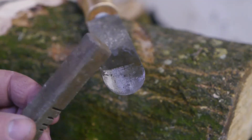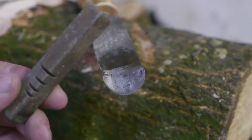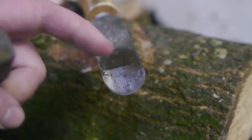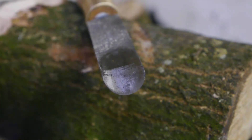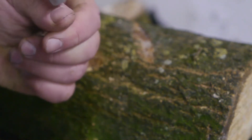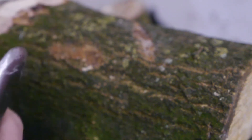I sharpened the edge as good as I could using this old stone that came with the lathe. It has a rounded-up edge so I could deepen the inside with it. It is really sharp — I will not test it on my fingernail. No problem scraping a bit off. I'll do that again later on when I rough down the log to see how well it held up.